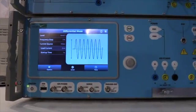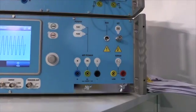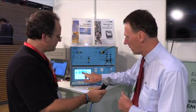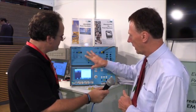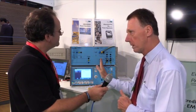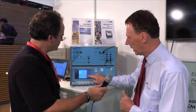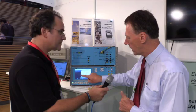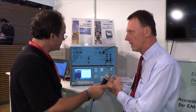So we have this all-in-one solution, which is an extension of the IMU4000. It's controlled from the front panel software, so I can just show you how we start up. We have inside the extension for the differential mode testing both the voltage and the current mode tests. We can select which test type we want to perform. I'll leave it on current mode testing. We can select the voltage profile, and this simulates the disturbance that's created by PLC on the power main. So you're actually seeing the waveform right here that's being generated?